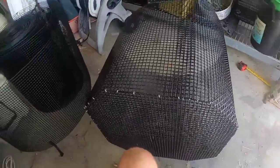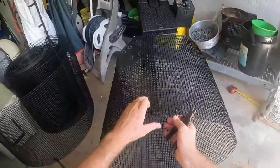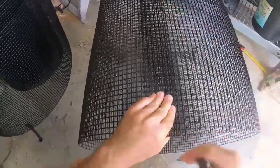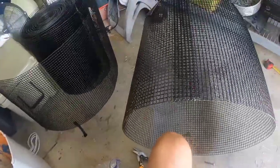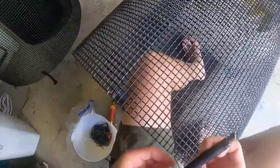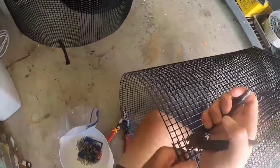Right here I am following my seam from the bottom of the pin up through the top and I'm just going to crimp, put a few stainless steel hog rings in place so it doesn't wiggle around on me. I'm following my vertical lines from the bottom of the pin up to the top here and making sure it's lined up. Because this material is square you need to make sure you get all your holes lined up. It's going to be really hard to do this — the half inch by half inch material — getting your hog ring pliers in there and smashing them down is going to give you some trouble.